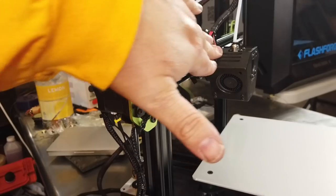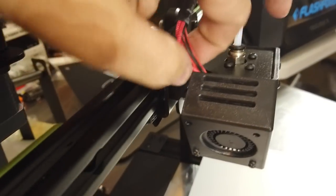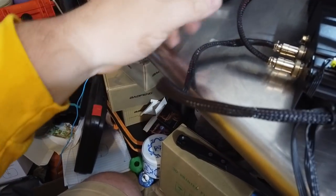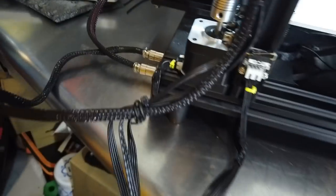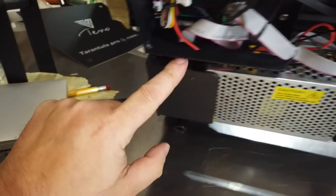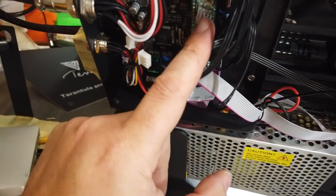Wiring and final hookup are now finished. PTFE tube attached. I routed the hot end umbilical down here, giving it a little berth so it doesn't get jammed in the gears, and kept it away from moving parts. Make sure the hot end cable goes underneath your other cables so that when the bed pulls forward it doesn't pull on the other cables. A little piece of tape on the end keeps the wire from getting stuck in that opening. I did creative rerouting — pushed a wire through the back hole so it comes out cleaner.